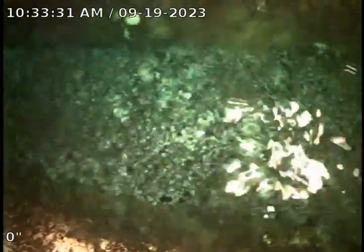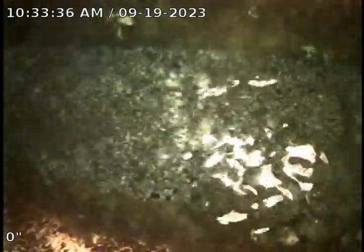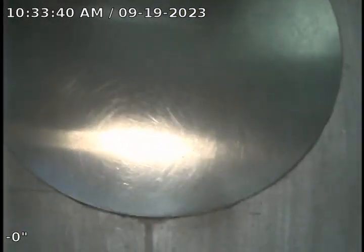As you can see here, we do have green. This was poured in the one drain, so the two patio drains are tied into the sanitary. We believe it runs upstream of the 6-inch backwater valve, which you're going to see here, that we can't get the inner lid off. It looks like the sleeve is the same size as the outer part of the lid.